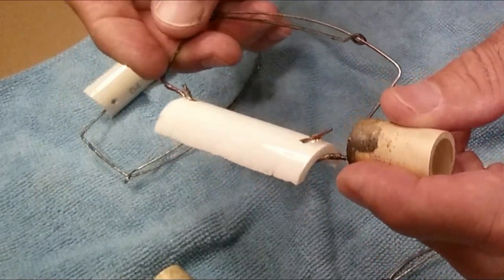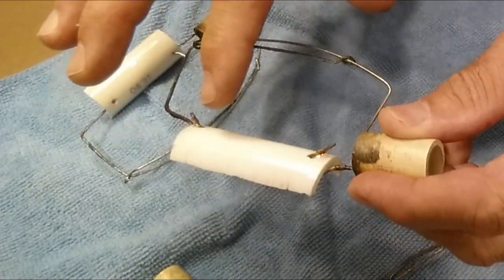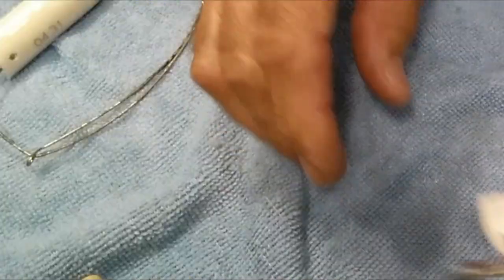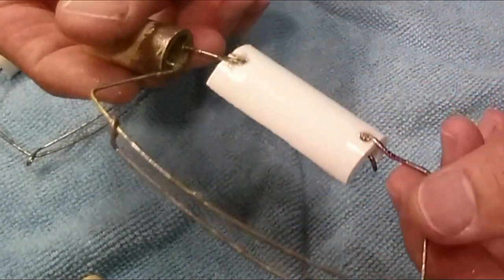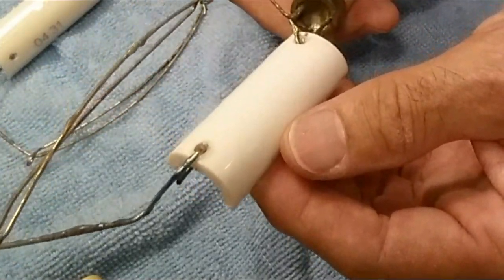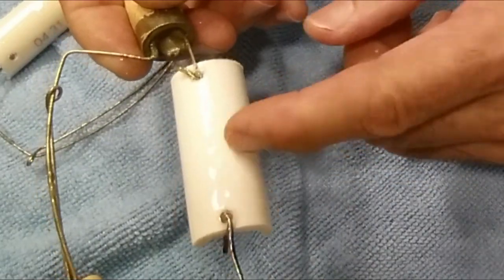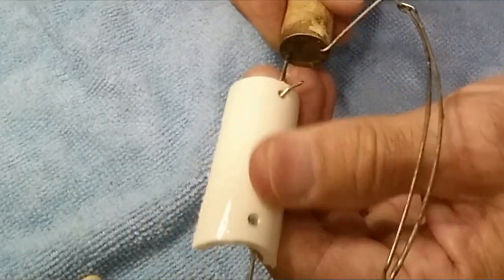This is the polyacrylic — that Minwax product that is water soluble, water clean-up. It did really well. There are some flaws but I have a feeling those were operator error — I think I screwed up and touched it — but otherwise it looks really good. I'd also call that a win. This is the floor wax, which I use a lot and almost always works, and the 'almost' is what I'm looking at here. You can see it's very ripply, which I've never seen before. Every clear coat I've ever put on top of floor wax has come out beautiful, so this is really valuable information for me. And finally the UV clear — it really likes the UV clear too: very glassy, nice finish.